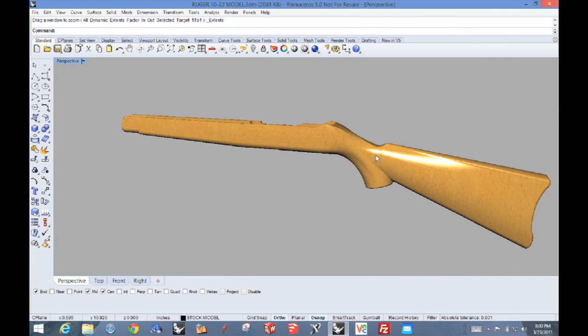If you think about it, there are really two parts of a stock. Let's unpack this a little bit. One is what is the outside shape of the stock — I can make any shape I want. What makes it fit the action is the inletting. Think of the inletting as the shape that you machine inside of that outside stock.